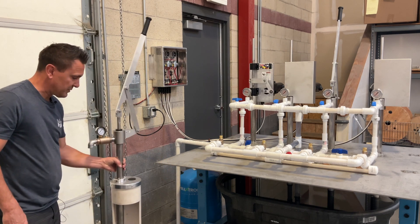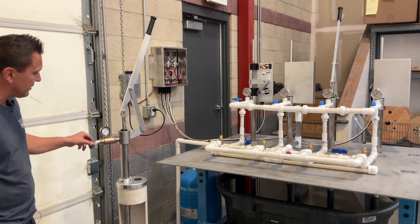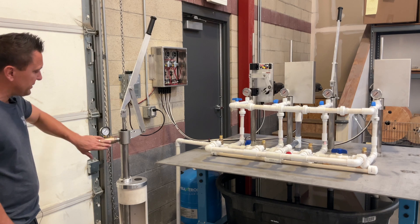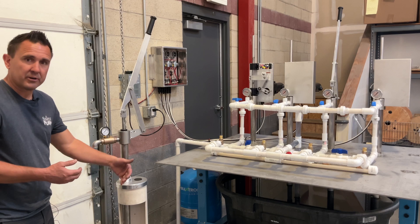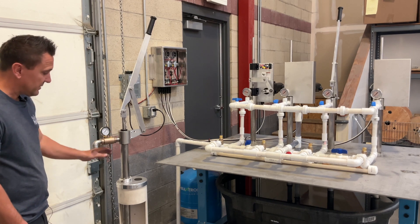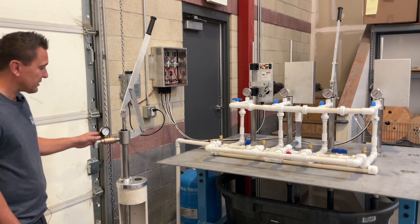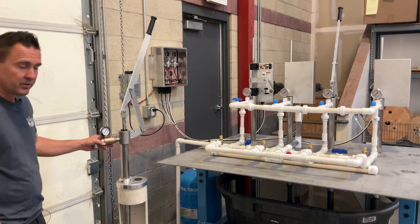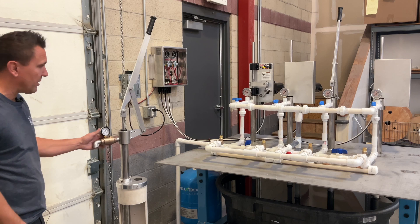What I'll do is bring in this setup here. This is our check valve and gauge kit. Here's the check valve — you can see there's an arrow pointing the direction the water needs to flow. The pressure gauge allows you a reference when you're pumping so you can see where you're at and don't overpressurize your tank. What this check valve does is: in most cases you have a weep hole, and as that pressure grows, if there's back pressure, it's going to push more water and more loss through that weep hole. But if you pump the water up past this check valve, there's no back pressure other than what's in the pipe itself back on the pump. This is definitely necessary if you want to pump into pressure, for both the suction pump and the deep well hand pump. Even if you're filling a tank through a hose with a vertical lift of 10 feet or more, you're going to want one of these because of that back pressure.